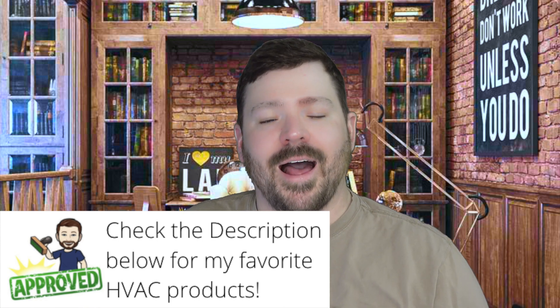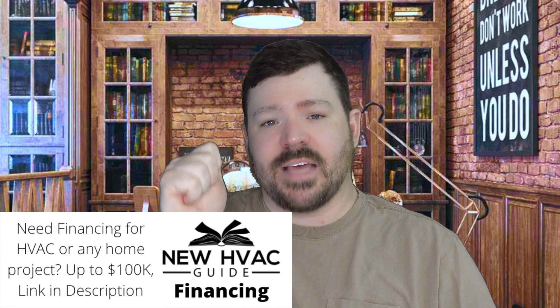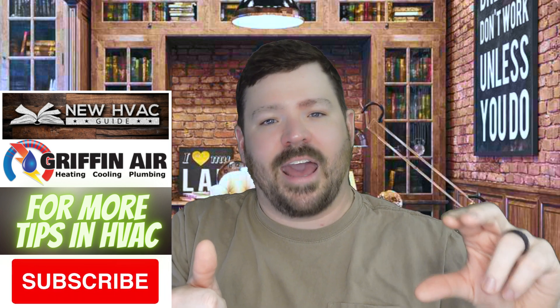So what's the big deal with the VRV Life? Because of that combination I was describing, it can do all those things — wall-hung, floor mounts, all the mini splits, pancake air handlers. And now it can be combined with a regular gas furnace in your home — a Daikin gas furnace blowing through ductwork, just like you've always been used to — paired with this outdoor unit, creating a dual fuel system where the VRV Life drawing very little electricity can still provide heat at lower temperatures than ever before, then switch to the gas furnace below a certain outdoor temperature.